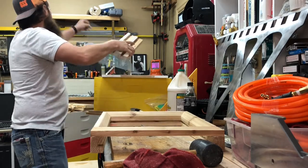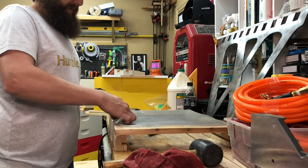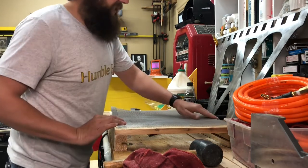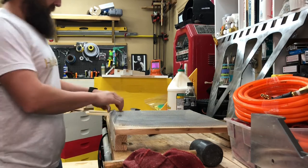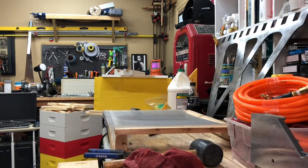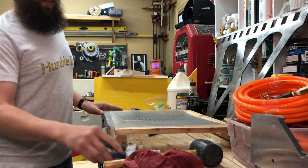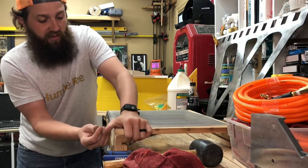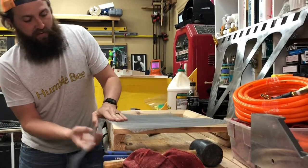Now the screen. You'll notice that the metal screen they give you is a little bit too big. What I do is line up two of the sides — one side and the back — with where I want it. Then I fold up the other side and give myself a little cut line. Then I get my tin snips to get it all fit and perfect. One trick: once you get your excess folded and make a starter cut, sometimes you can tear this on a seam. That's a little faster, especially if you have a bunch of these to do.